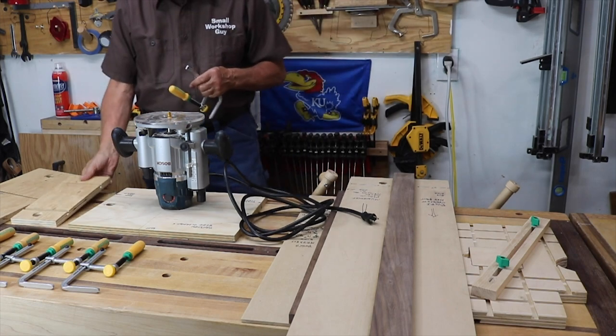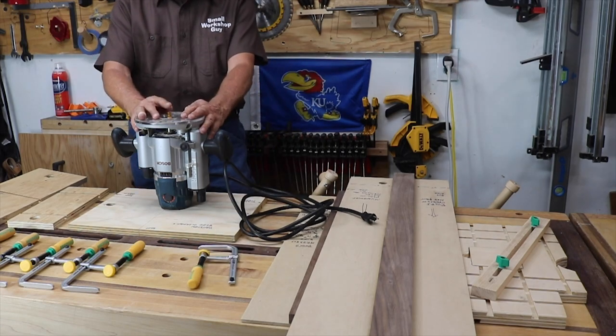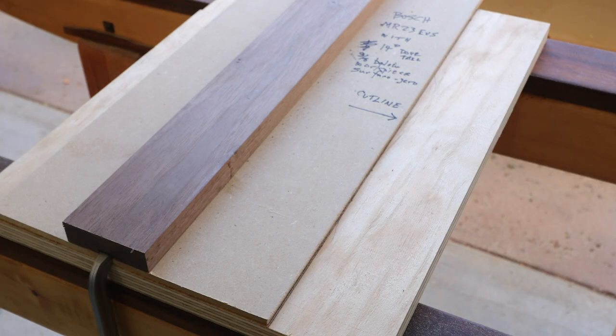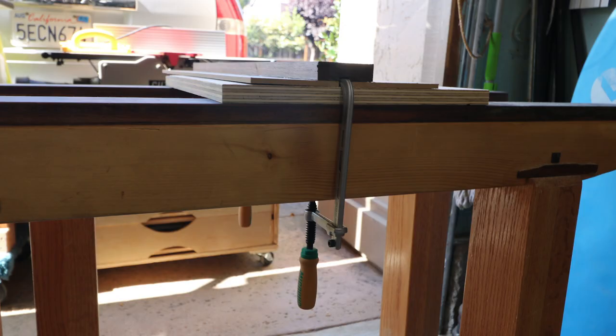Here are the eight things that I have done. When you do the groove, you do it three-eighths of an inch deep into the workpiece. The first jig is a cutting guide designed for a router with the dovetail bit. As you can see, the clamps are completely underneath and nothing is above the surface to get in the way of the router — that's the concept.